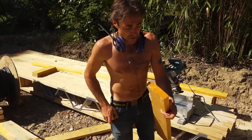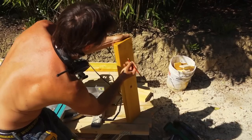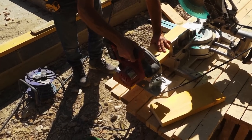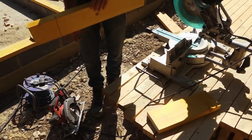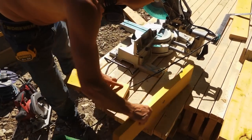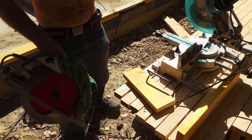You can set them all out, cut through with your saw, and chisel in from the end — but what's actually best is when you use a circular saw. Put a half lap on there, put a centre line down, mark which side you're taking out, and use the small circular saw like that. Then I've got my C9U3 for doing this.